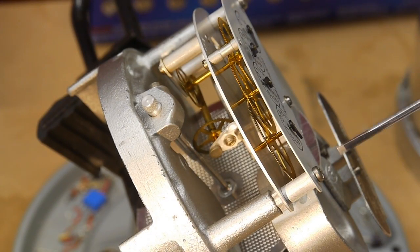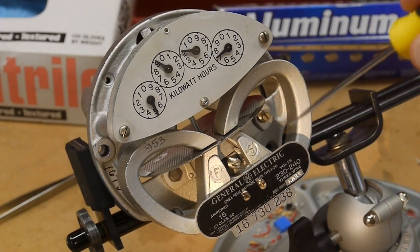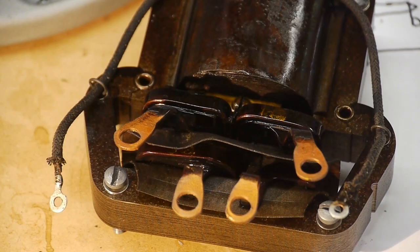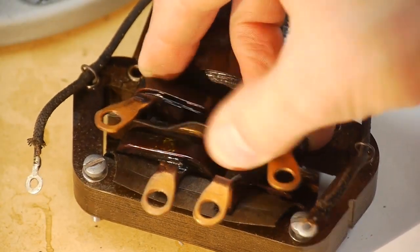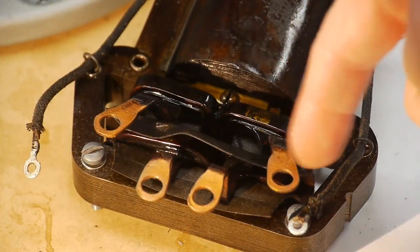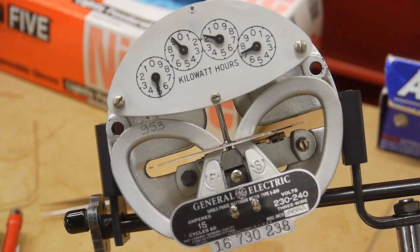Of course there's also a super high ratio reduction gear train so all the rotations of the disc get divided down to very small rotations of the dials on the front. I've often wondered about the stippling pattern pressed into the aluminum disc - I always thought it must have something to do with eddy currents, but I think it's really just to make it easier to see the disc spinning or to make it more physically rigid. This particular meter also has an unusual current coil configuration - one coil that is symmetric and another that is asymmetric, with only one turn on one side but a few turns on the other. I have absolutely no idea why you'd want an asymmetric setup like that - it might be to produce a slight amount of torque in the static case to overcome mechanical friction. If you know, please let me know!